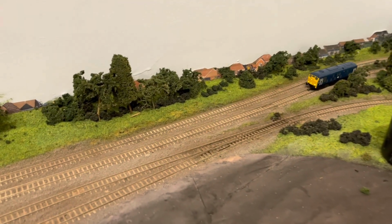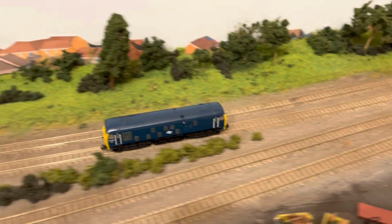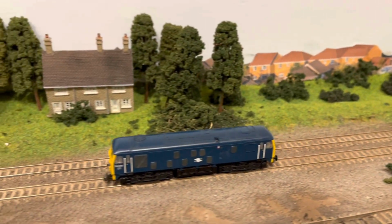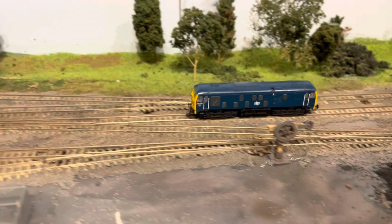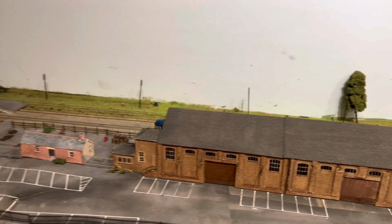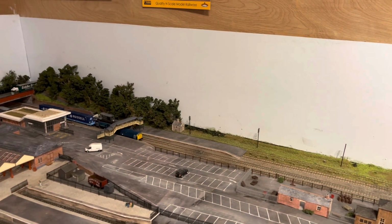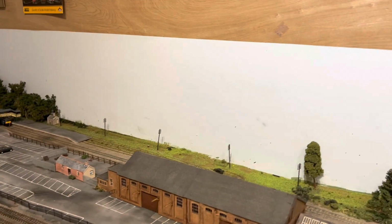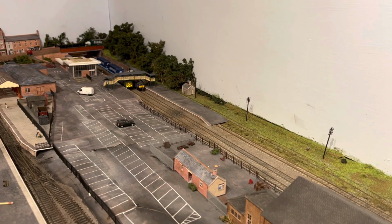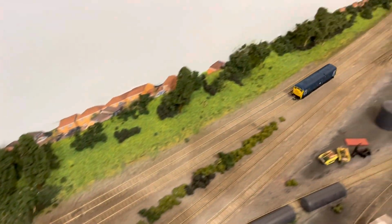I did learn a lot during this video, and hopefully you've learned something too, but if not, I certainly did, which is mainly don't just stick a new DCC chip in if there's a major problem, because if something has shorted out, you're going to cost yourself a lot of money. So that's a medium speed pass, looking good. And don't just start buying parts. I essentially wasted 20 quid buying a new logic board which wasn't really needed. Really try and diagnose the actual fault, the root cause first.